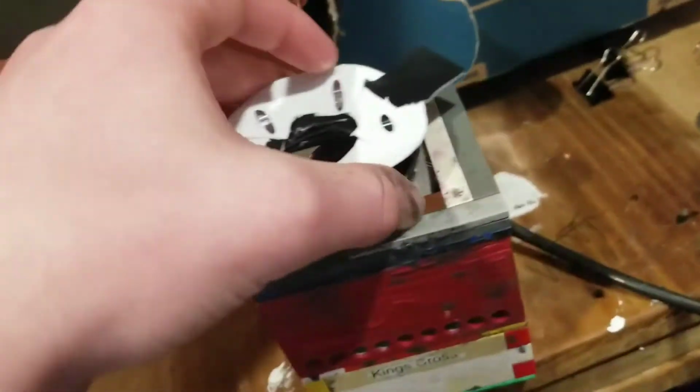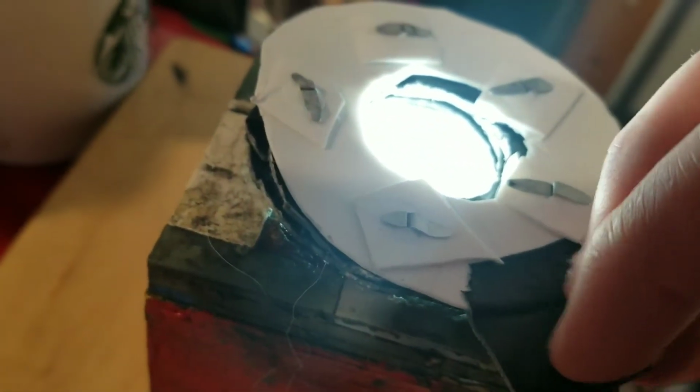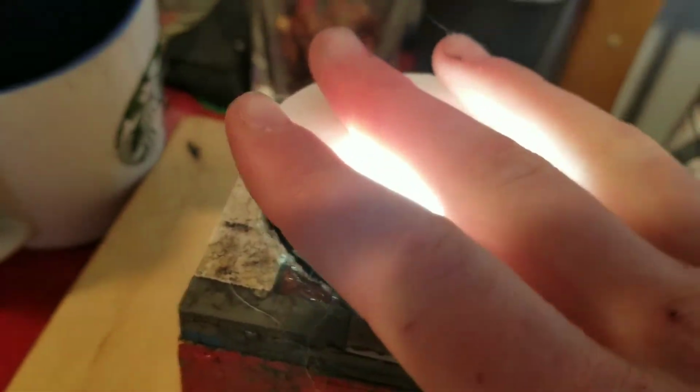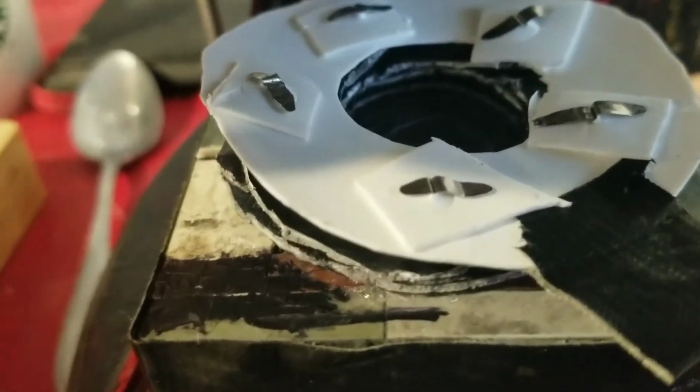And now it is time to center this way. Look at this. You can open and close it at will, allowing you to adjust the amount of light. Instead of having two diaphragms, since it took so dang long and it was so frustrating to build this single diaphragm, I've decided to have one diaphragm on top of the collector, since I don't really need a second one, since I do have a dark field filter and polarization for up here.